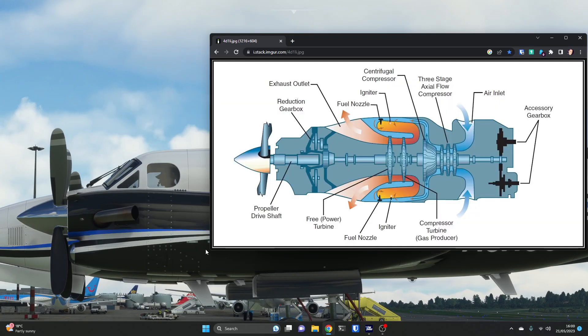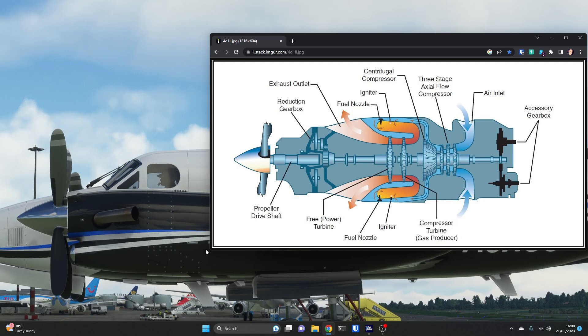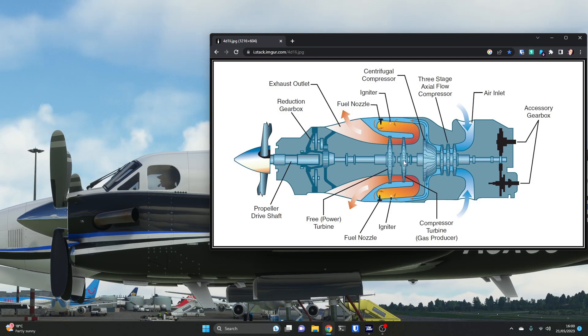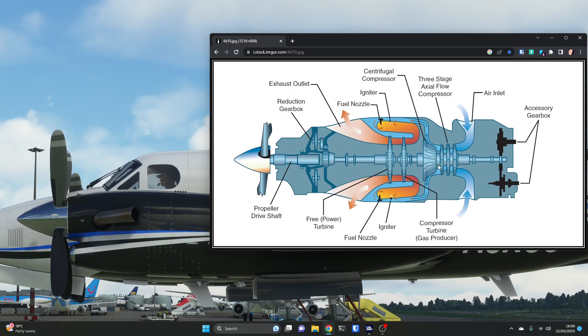It's a very good diagram which shows an overhead view of the same engine. So you will notice down the middle of the engine there are a number of axles. There is an axle at the back with compressor blades on it — this is actually a gas turbine engine. And what's kind of interesting to me is it's pointing backwards. So the air comes in through the front of the engine, is sucked up at the back of the engine into the turbine blades, and then is pushed into the combustion chambers.